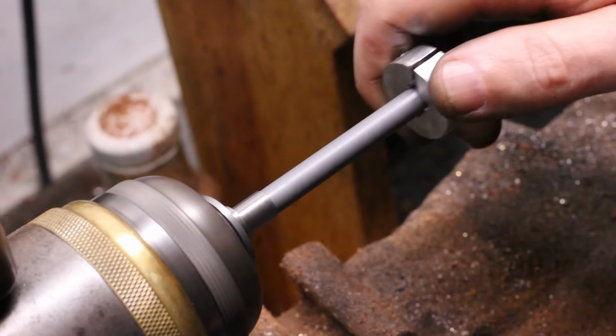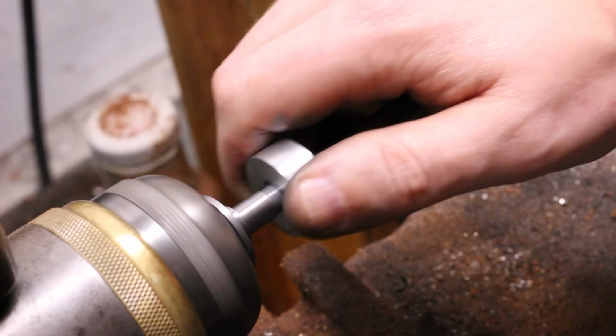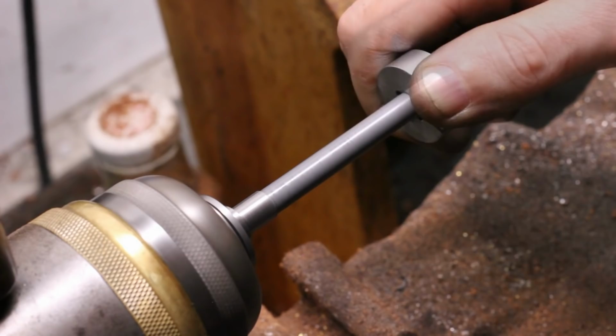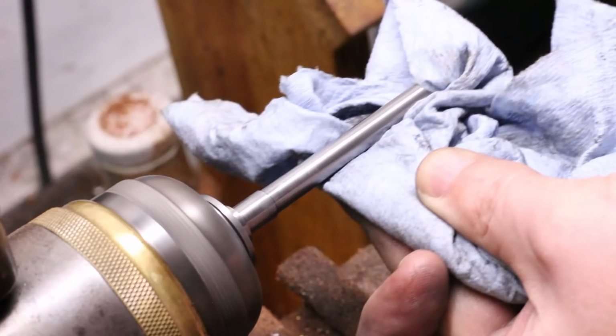It took quite a few passes to even out the diameter, but really didn't take very much time. And I was real happy with the end result. The consistency in diameter was good enough that I couldn't measure a difference with my micrometers, and the abrasive seemed to crush down pretty quickly, so the finish was a lot finer than I originally thought it would be.